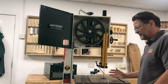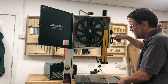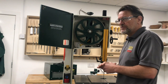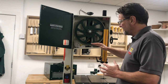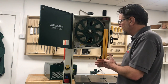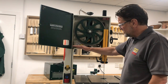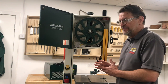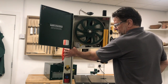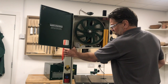The best place to feel for tension, no matter what bandsaw you've got — and we range from different diameter wheels across different bandsaws, from the 250 right up to the 450 — is to come to the bottom of the wheel and come across. This is the most precise measurement point and it's going to give you the same feel on every bandsaw no matter what size you've got.